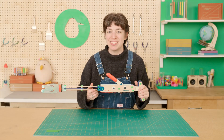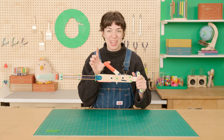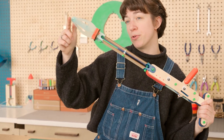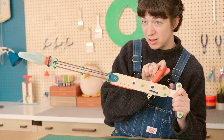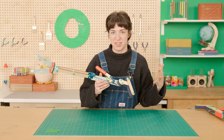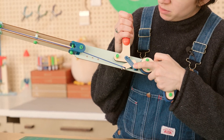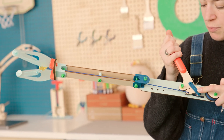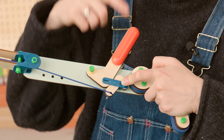There's a lot of really cool science and engineering that goes into your grabber. This big red handle is actually a giant lever that allows you to pull that string back with a lot less input than you get for pull strength. So if you pull it back just a little bit, you can see that string start to move backwards — pull it all the way back and it locks. Here's a mechanical grabber where I've pulled off the sides so you can see: as we pull the big red handle back, the string moves back and that's what closes the grabber arms. Pull it all the way back — chunk — and it locks itself into place.